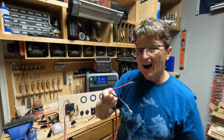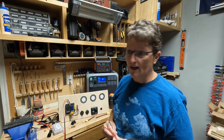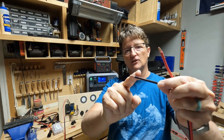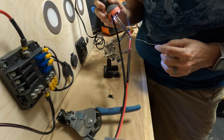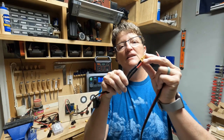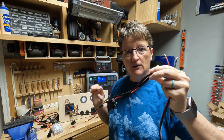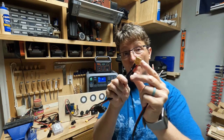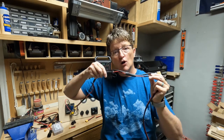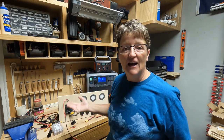When you make the cable, I use 12 gauge for everything, and then I do my inline fuse — a 20 amp inline fuse. So you get your 12 gauge wire and you need to connect your negative and your positive to whatever type of connector you're using. This one, for example, is the XT60 connection. You can see that I have this going to my fuse panel, and this is going to connect to my battery. About a hand's distance away, I've got my inline fuse. You want this inline fuse to be as close to your battery as you can get it.